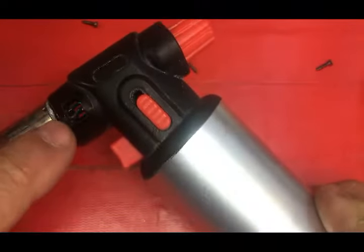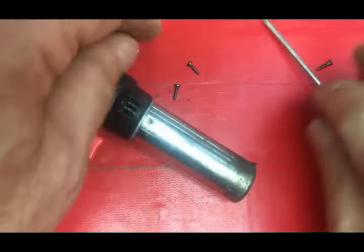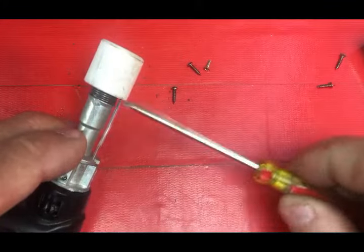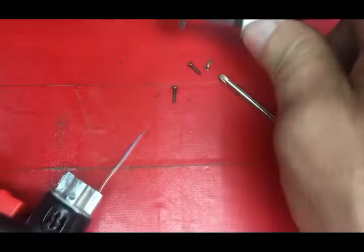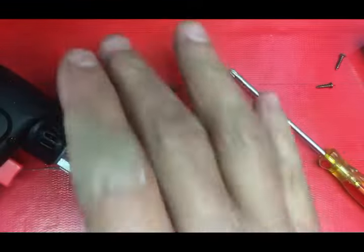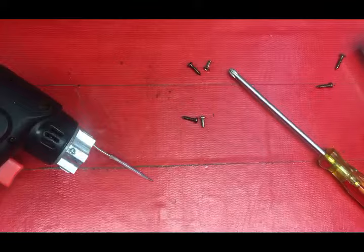This one again has been overheated really badly — you can see the burned area. In order to get the nozzle out which controls the amount of butane that goes in, we start by taking these screws off, then slide it out. Once you've taken those two screws out, you have to be cautious and note where this plastic tubing is, because when you put this back together that wire has to go inside that tubing so it holds it against this piece of wire here.